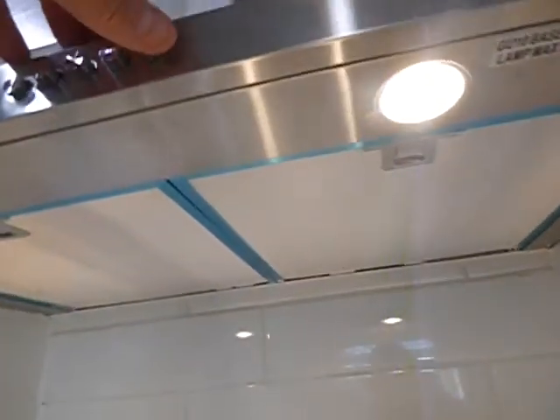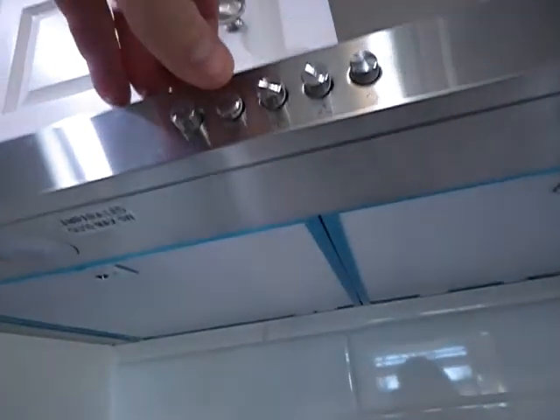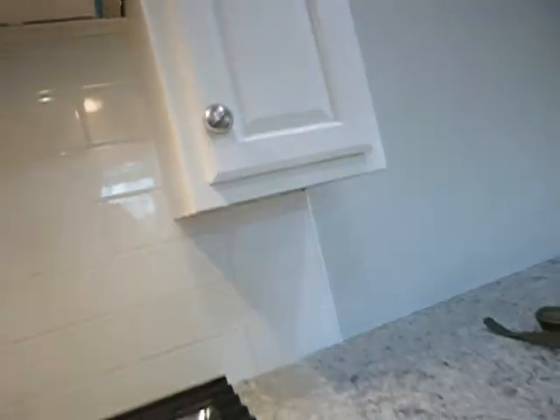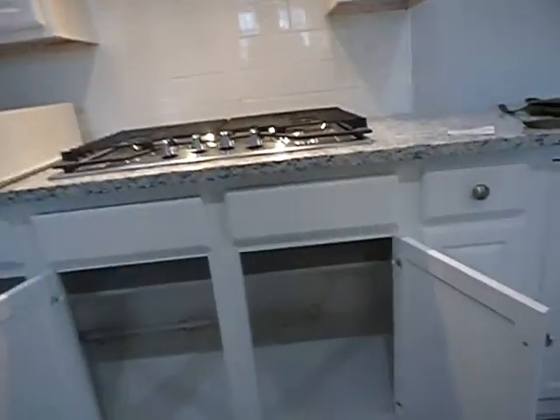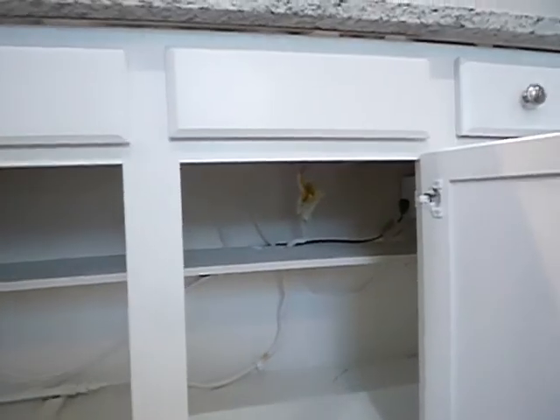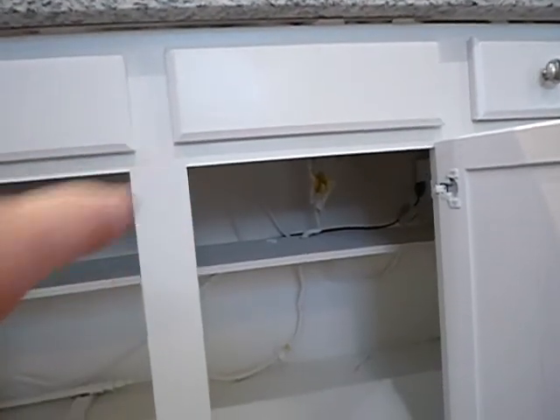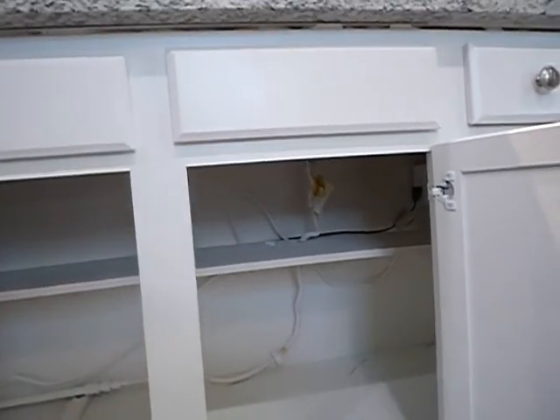These all come on — there we go, it's circulating. It's not vented out and it's high enough. This is the gas line coming to the cooktop. Unlike the water heater and the furnace, a drip leg is not required on this. You're not supposed to take a connector through the wall — there's a shelf right there, and I'm not particularly worried about that.